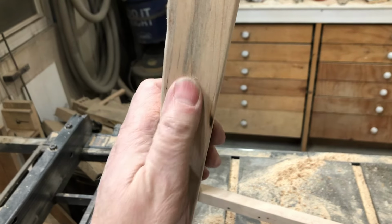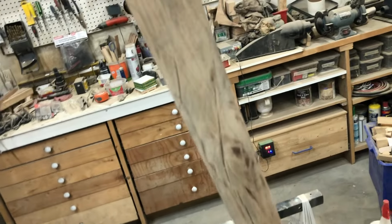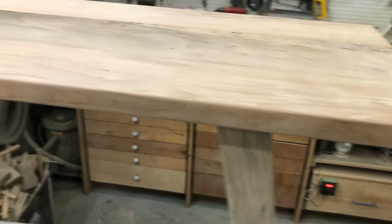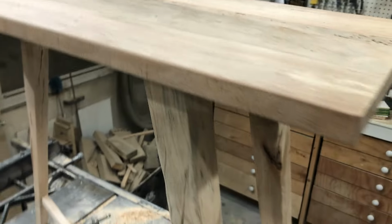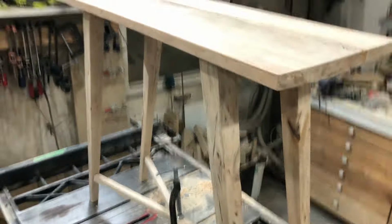A little bit of leftover glue drop. So our final sand will be with some 220 grit. And then we can apply a finish. Haven't decided what kind of finish we'll put on this yet. Might do a light stain. Anyway, to be determined. We'll put that in the next video. That's our table. Very happy with the result.